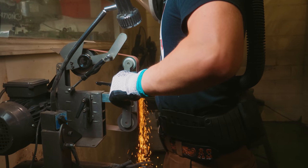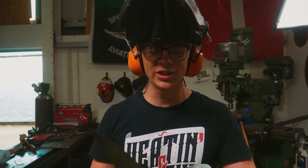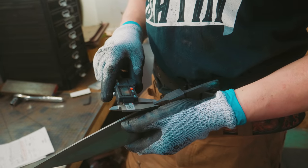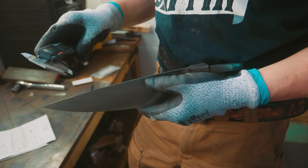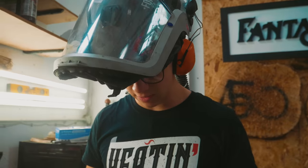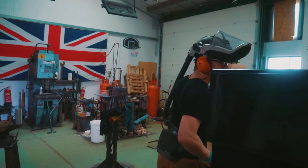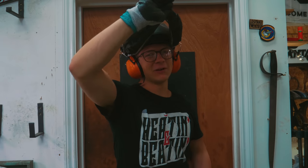My edge is still really thick, so we're going to thin that down. I'm going to take a pass at a much steeper angle than before — that thins it down. I want to make sure that this blade is centered to the bolster, super important. I'm taking as much time as I possibly can just lining everything up. We've got to think about the measurements we need. Since I'm just trying to copy one of Marekko's knives, here's what he told me: take the thickness where the spine meets the bolster to about 140–150 thousandths, and take the edge down to about 20 thousandths of an inch, with a full distal taper. My spine right now is about 200 thousandths, my edge is about 50 thousandths, so we are a ways off. We need to take still 70 thousandths off the spine and thin that edge significantly. We're still at 36 grit — and I think we've got to do an S-grind.